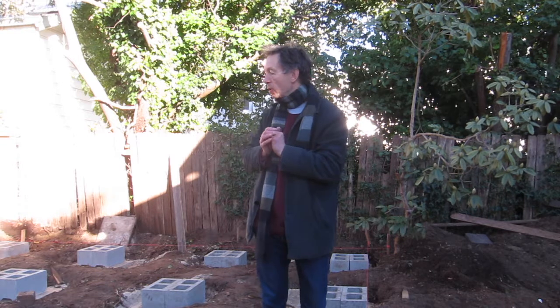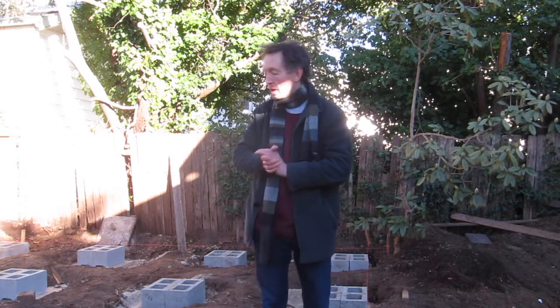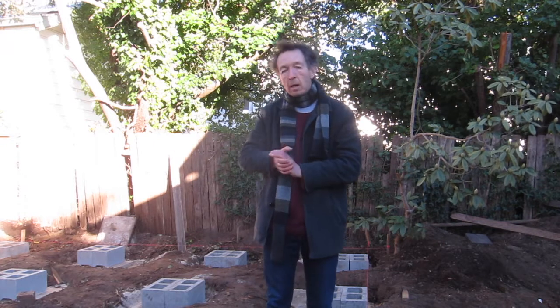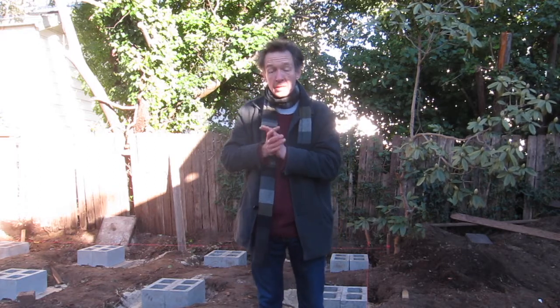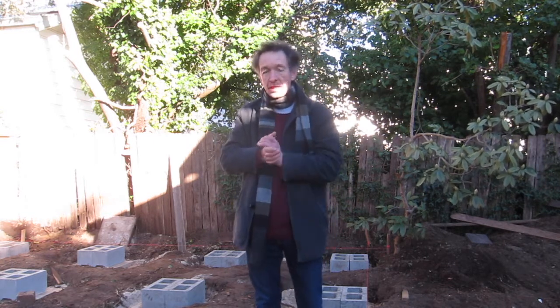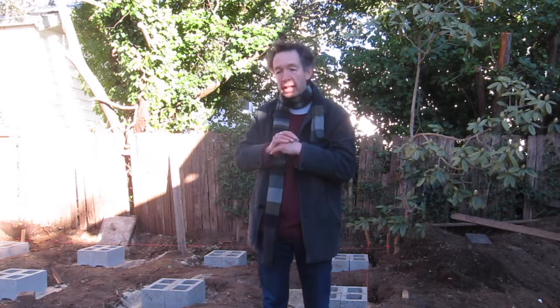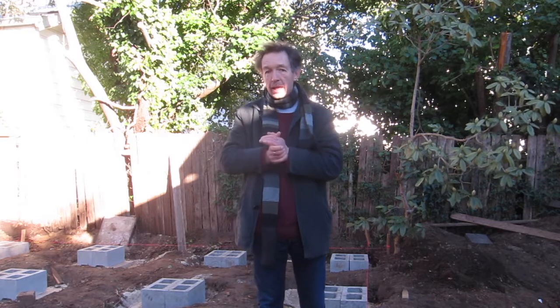and this will take basically the foundation of the main building. It's been a challenge even getting these besa blocks and all of these foundations in line, because each one of these blocks has to be perfectly straight and in line with all the other foundation blocks. That was quite a challenge to get there, and it meant moving sand and digging it away and making sure that the blocks are completely level, and it's very, very important. This has actually taken quite a number of days.